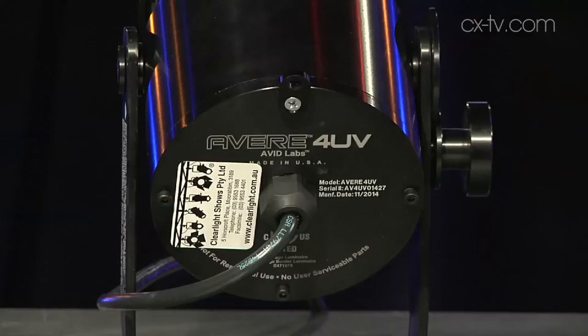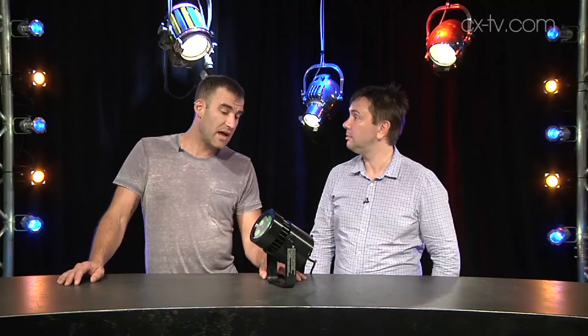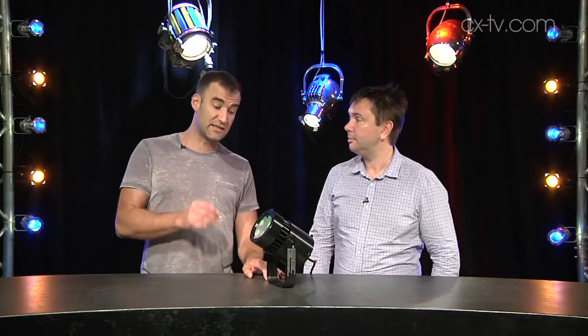We've got our little safety wire attachment point, which I think is a nice touch. They of course sit behind the nice polycarbonate front lens, which is attached to the nice aircraft aluminium machine barrel, which sits on the nice yoke with the beautiful locks. You really couldn't ask for a fixture to be more beautifully built. It is also completely convection cooled — utterly silent, and not just in the sense that there's no fans. We've seen fixtures in the past where we could actually hear the control electronics for the LEDs operating. This is legitimately 100% silent.